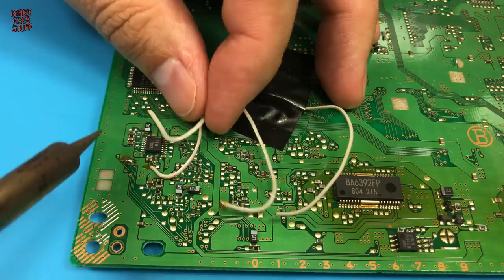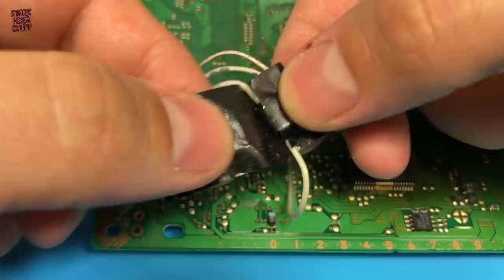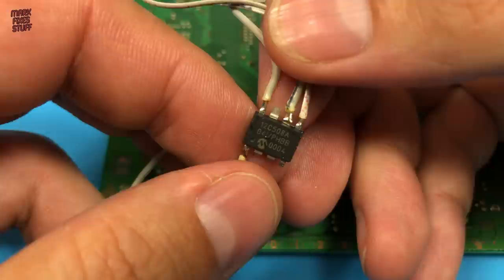We'll just melt the solder and clean up the points with some solder wick and flux. What's hiding in here? It's a 12C508A PIC chip with a full wire install. Not really sure what this might be. Maybe a later MM3 version?